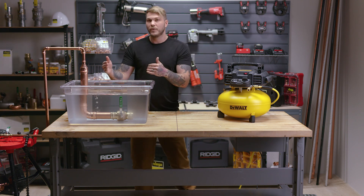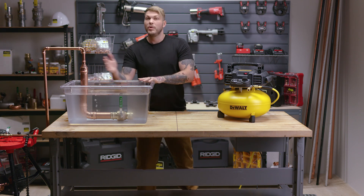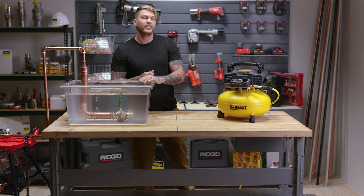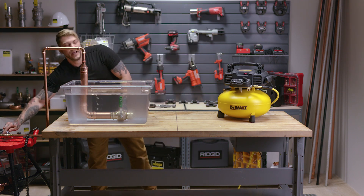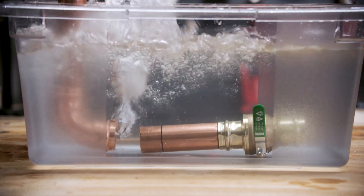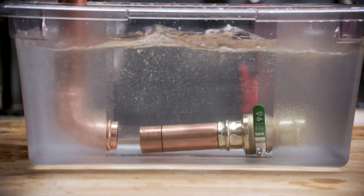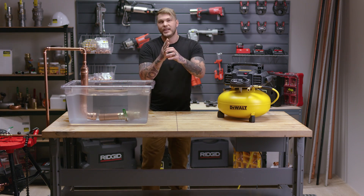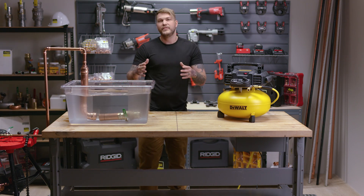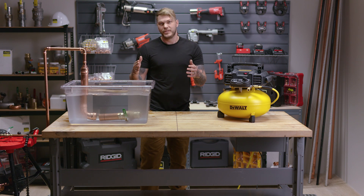The worry is that if we go above 45 psi on an air system, we will push it in there and we can cause a failure on that system. So if I increase the pressure and open the valve all the way, you're going to see that it pops right off. That sealing element was shoved into that indentation — we caused a false positive and we did not follow the step test procedure.